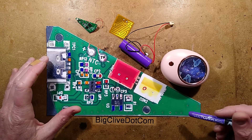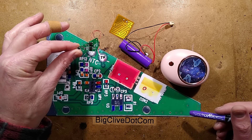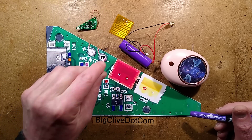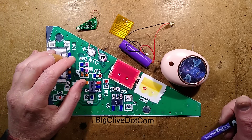Reverse engineering is complete. Let's explore it. The circuit board isn't too bad — it's a lot more sophisticated than I was thinking it was going to be. Very neat indeed. The heater is also quite interesting: it passes 1.25 amps at 4.2 volts and 900 milliamps at 3 volts — fairly capable.